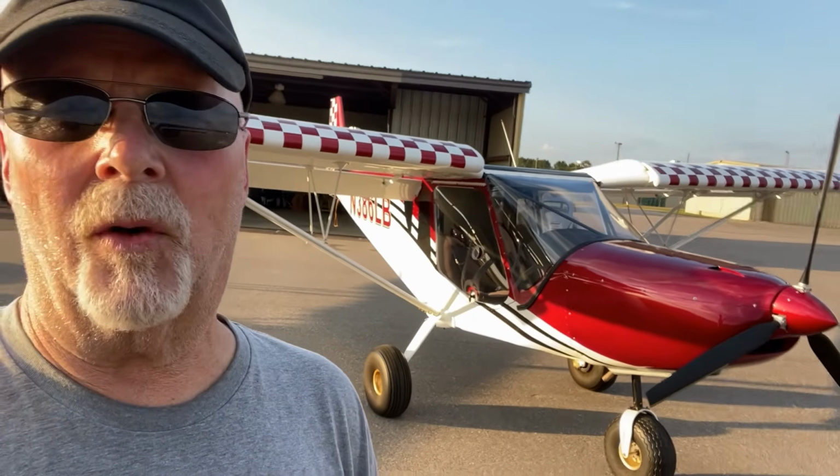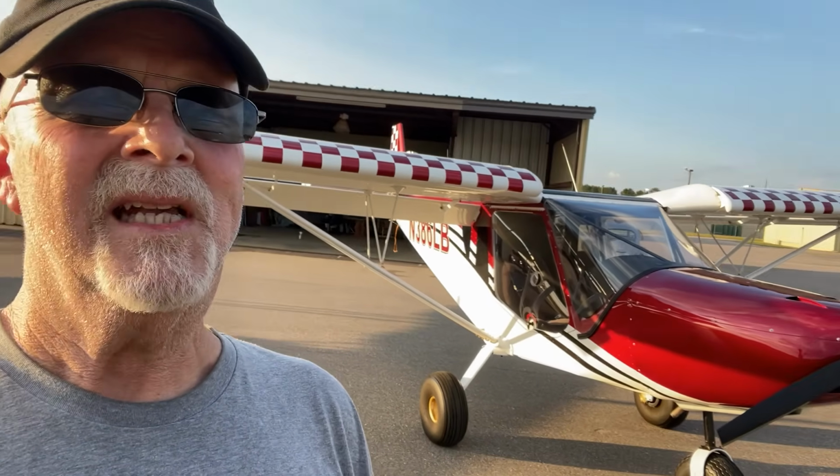So at 5,000 RPM, I go in the four cardinal directions, and then you divide by 4. That's your airspeed before the fairings. Then you do the same thing after, and you get a general idea of where you are. The thing that I've got going on is I currently have my airplane set to almost exclusively full climb.